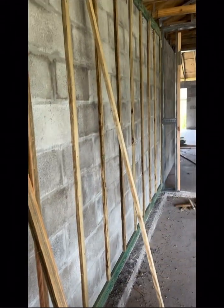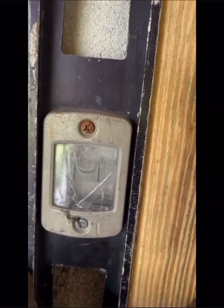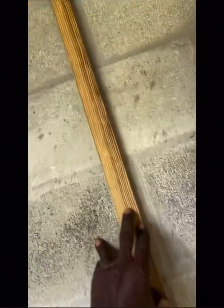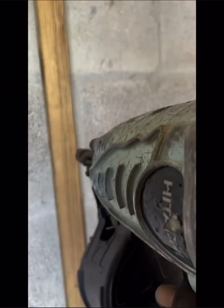As you can see, we're lining up our furring strips on the wall, making sure they're straight and level. Then we're going to fire nails using our Hitachi nail gun — nailing straight into the concrete. These are inch-and-a-quarter drive pins and they attach straight to the concrete using a pneumatic air compressor.